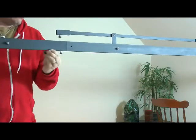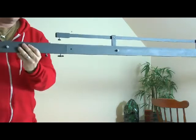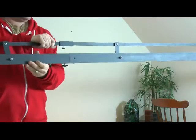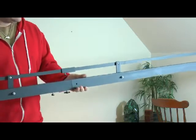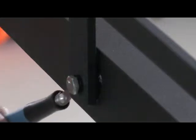Mounting the head onto the main body: if you do the outboard one first, then the inboard one, it stays a little bit more level. They tighten right up. You can see how the lock works in the coupler for the leveling rod. It was a little cumbersome at this step. Here you can see more bearing surfaces where the leveling rod goes through the main body — they thought of everything so it doesn't wear the aluminum out over time. They have a really nice insert there and the washers.